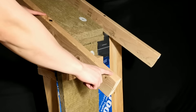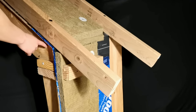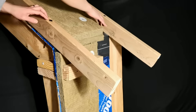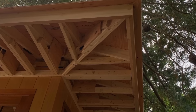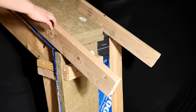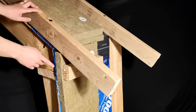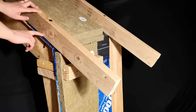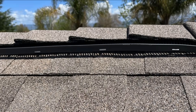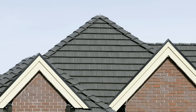To provide the overhangs, we are using an outrigger system — essentially, two-by-fours fastened into the roof structure with heavy-duty wood screws. We really like the Simpson SDWS screws, and those outriggers will be fastened based on your structural engineer's fastening schedule and specifications, which is largely dependent on the size of the overhang and the loads imposed on it. Smaller overhangs are going to be easier to integrate, whereas deep overhangs will likely require a more heavy-duty outrigger system. In many cases, your outriggers don't actually need to extend all the way up to the ridge, so you're usually not getting a huge thermal bridge, and we don't have a massive fascia profile. You wouldn't even notice that this roof has exterior rigid insulation unless you peeled back the soffit board. Same as the previous strategy, you can choose to vent the roof covering or leave it unvented — all of the same principles apply.